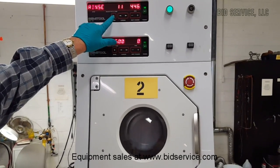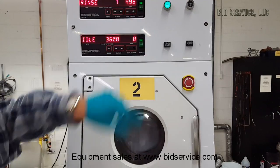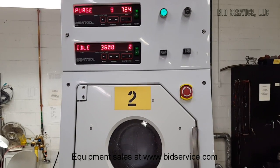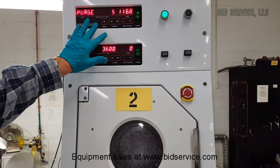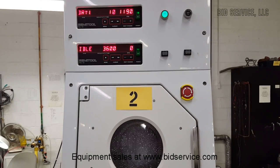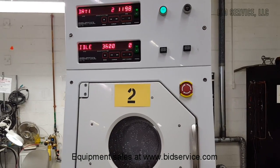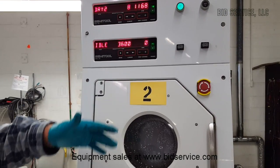You can see I did the rinse time that I changed to 15 seconds at 500 RPM, showing you the actual RPM. Going through a purge and you can see we've ramped up. Now we're into a dry — so we've gone through a rinse, gone through a purge, and now we're in the dry cycle at 1200 RPM, and then dry two, which might have different settings.